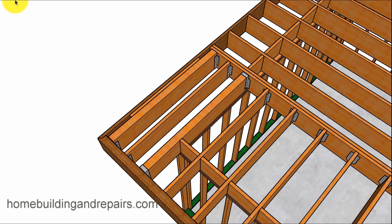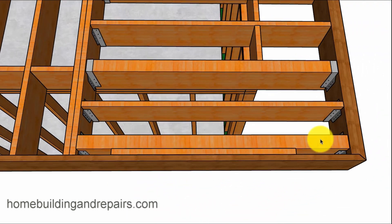If there's going to be a lot more weight on the outside of the fascia board, you could always install a beam. So here we would have a beam coming across instead of a joist, with a spacer block you can nail to the beam and then nail the fascia board to the spacer block to make it stronger. You could also use an inverted or concealed hanger and move the beam out to the edge, right up against the fascia board, so you could just nail the fascia board into the beam — giving you a nice solid perimeter.